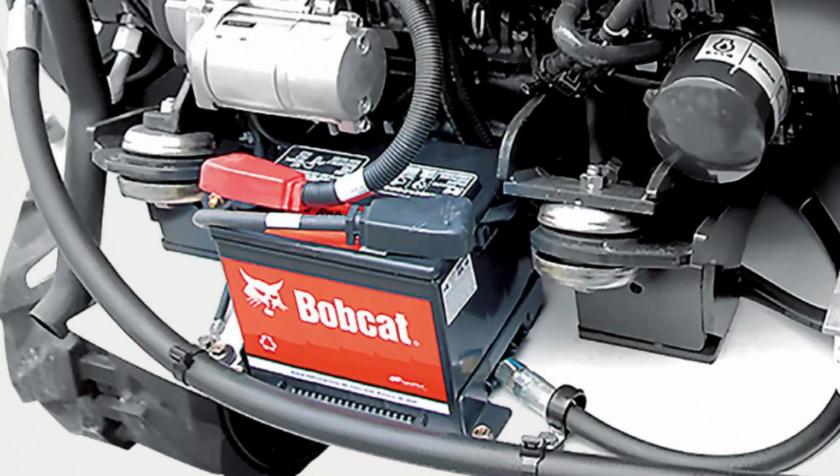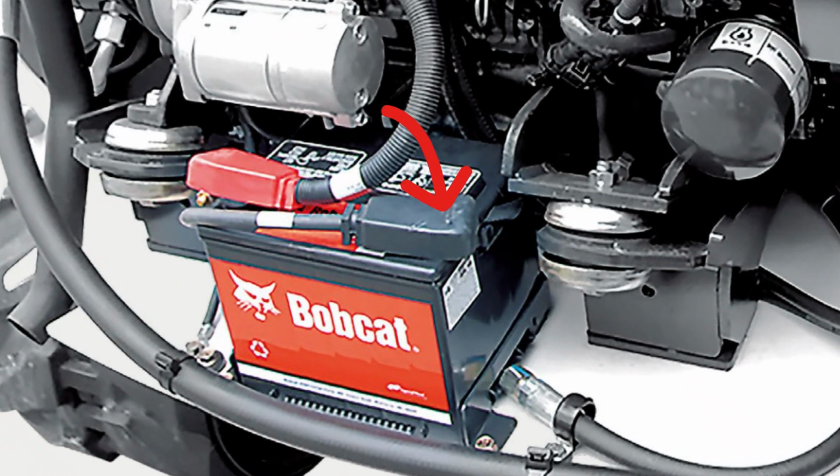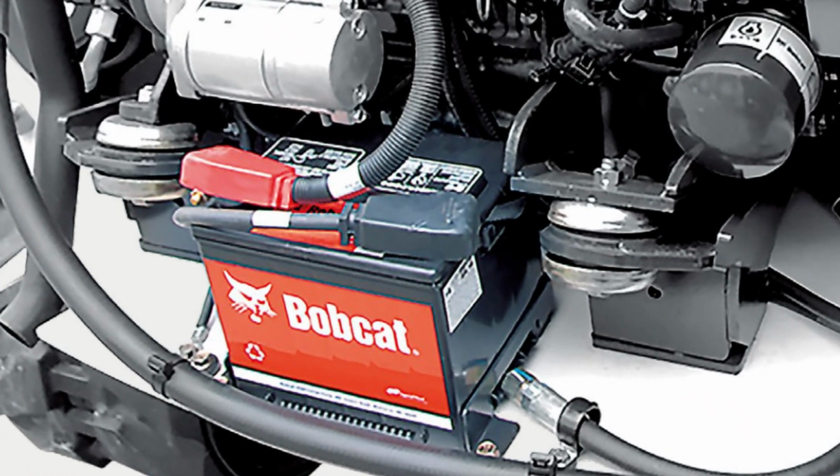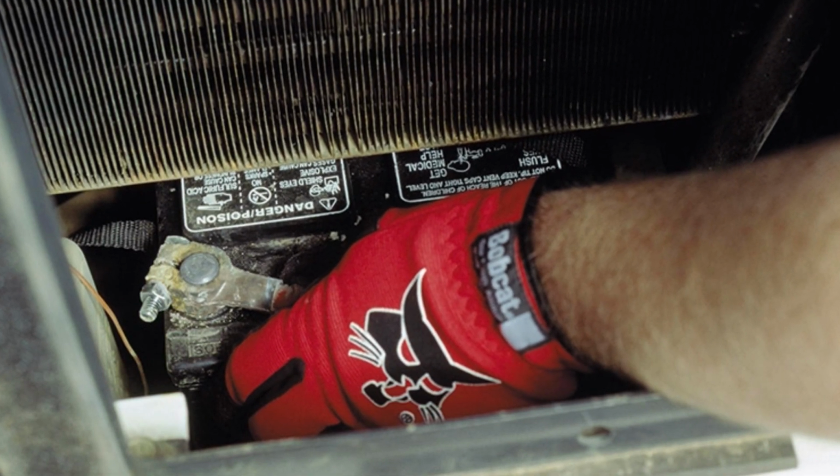So to start with, I would check the battery connections and also the ground connection. The ground is the cable that's connected to the minus terminal of the battery. Track it down to where it's connected with a metal body part and make sure those connections are tight and not corroded. Also, try moving the battery connections. If they are loose and you can move them without loosening the bolts, this is most likely the problem. They should be tightened properly.